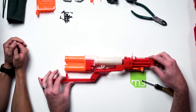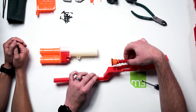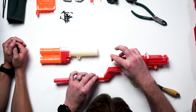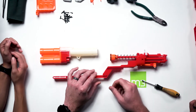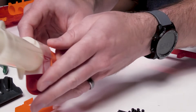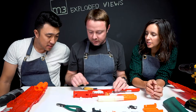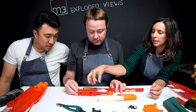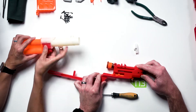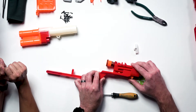Here's the charging handle, which is connected to the plunger. The piston has an O-ring with a little bit of oil or grease on it to lubricate it inside this air cylinder. You can see the air passageway up in there. The gist of it is that you're pulling something back that's loading the spring, popping the plunger through. There's a big tube, and then the spring gets cocked.